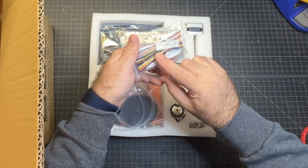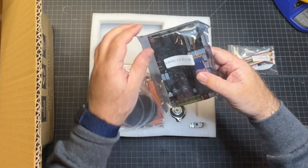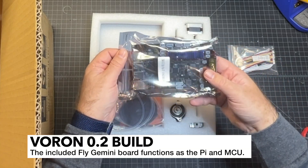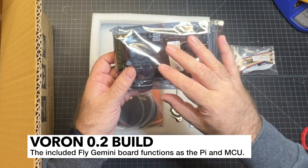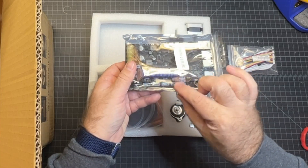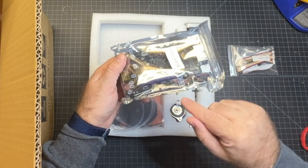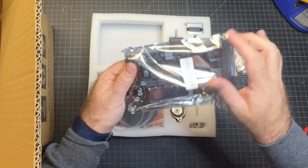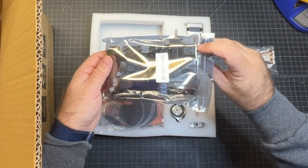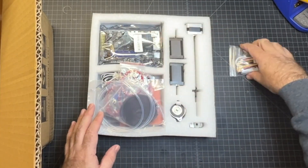In this section it's going to be our control board. Here is the Gemini Fly version 3 — I've never used this board before but it does have kind of the equivalent of a Raspberry Pi on board and it also has the printer MCU. All of the drivers are pre-installed even with the heatsinks. I can see a lot of the different connectors — those appear to be JST, probably XH. We've also got USB and an ethernet port. Everything we're going to need for the control board and Pi is already here, so that'll be new for me because I've always gone Raspberry Pi.